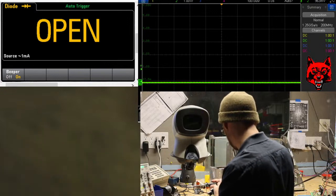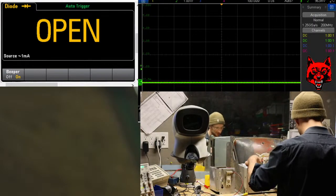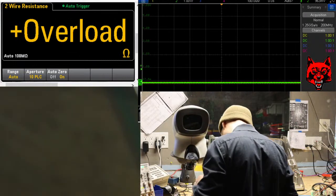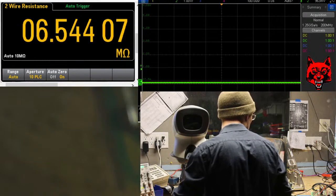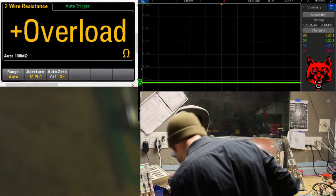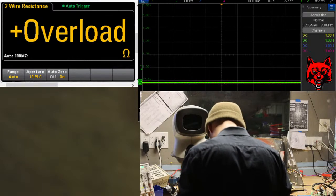There's some small signals that are going to get changed. Oh yeah, these burnt resistors have to go. These are supposed to be 390, I believe. So let's look at that. Should be able to see that on the meter there. Whoa, is that open? Am I hitting the right one there? Nope. Flip the board. I don't think I can get in there. There it is.